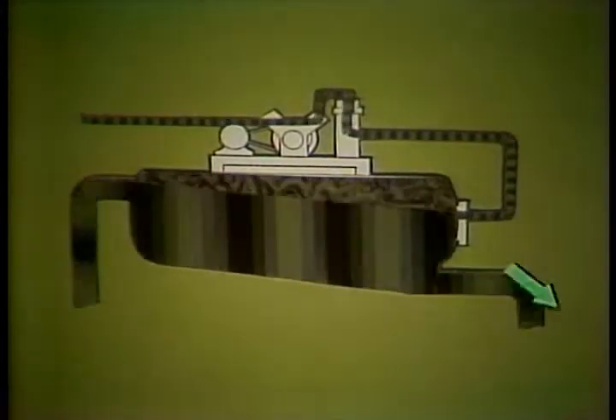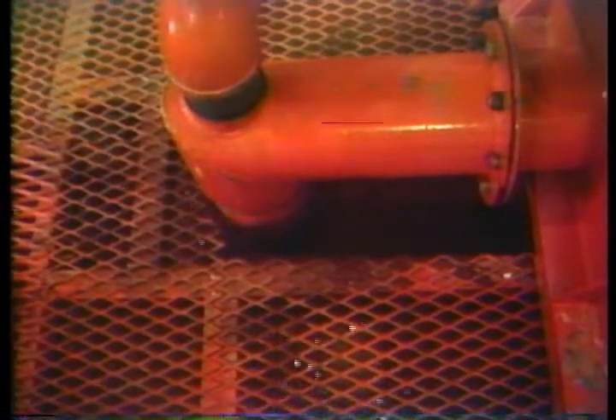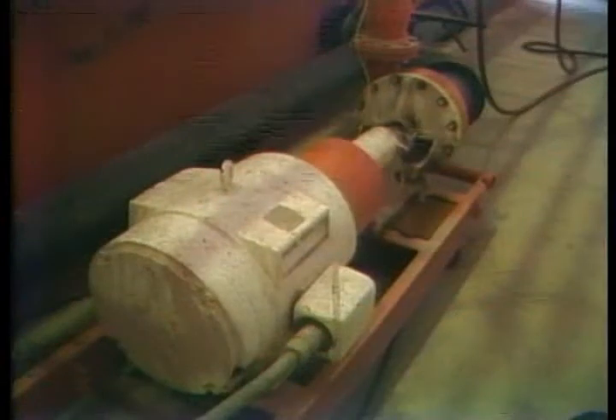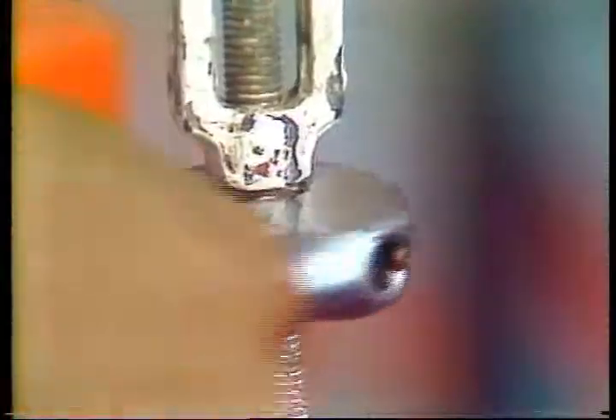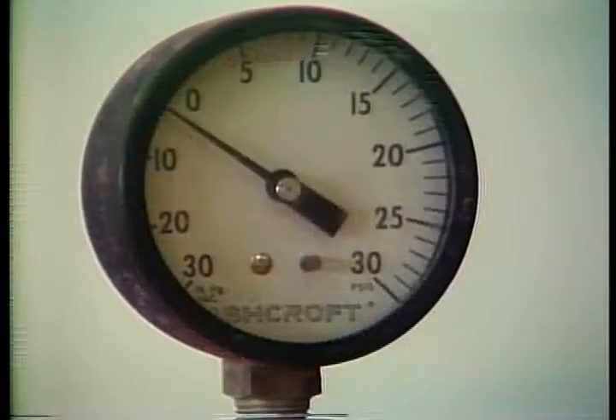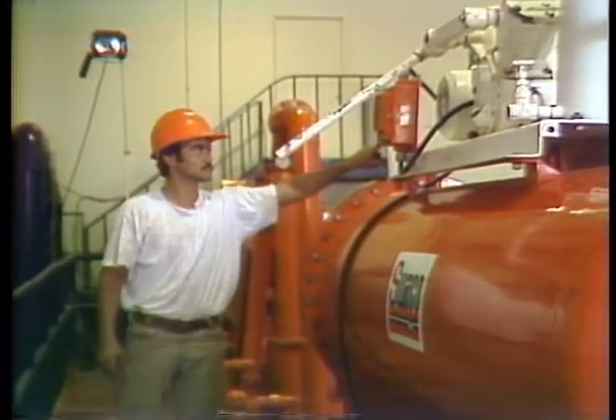After falling off the baffle, the degassed mud is carried out the discharge line into the second mud pit. The jet nozzle keeps the mud moving out of the tank and controls the volume put through the degasser. The pump feeding the jet nozzle draws mud from the second tank, which contains previously degassed mud. It's a foolproof system designed for simple operation and a long life.